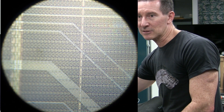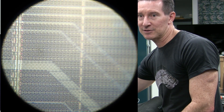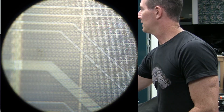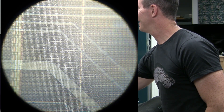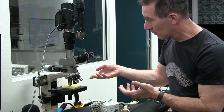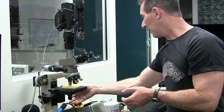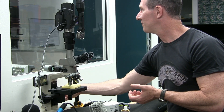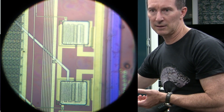Oh, that was slightly different actually. You can see the different layers — the traces running on top right over those cells, power traces, everything. My die's not completely flat — I can see the focus is on one side then I sweep across. That's how just a slight tilt in your XY stage makes a difference, especially when I've got it on a Post-it note just to prop it up. My stage actually doesn't go high enough for this thing — I've got to fix that. What's on the side of the die here? That doesn't look like a pad — those are test patterns down the side.